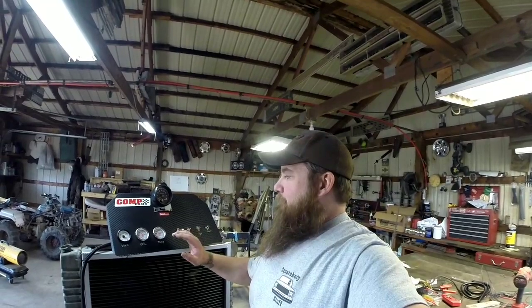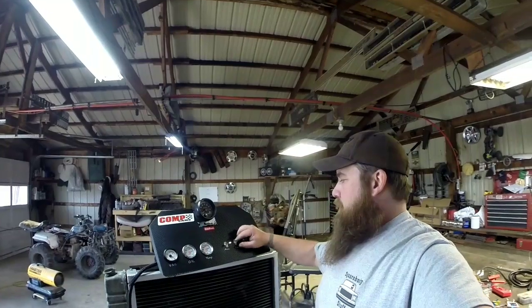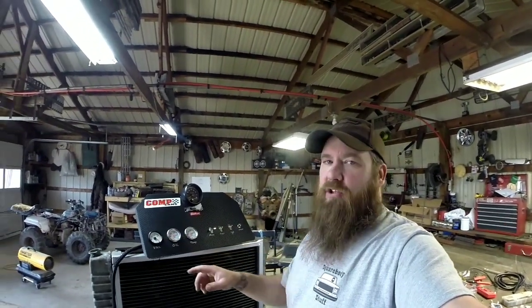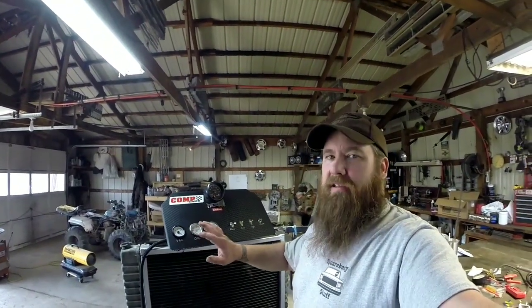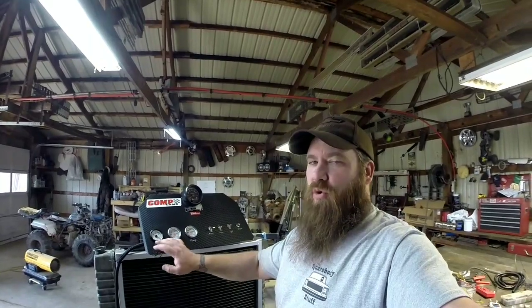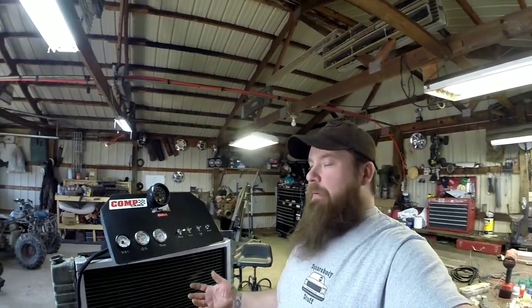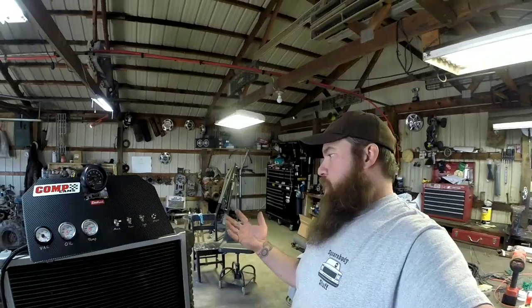But I've got vacuum gauge, oil, temperature, my main switch, fans, ignition, start, tack. It all works. I've kind of tested it. The only problem I've had is my cheap Amazon vacuum gauge. It doesn't read as accurate as I'd like. It reads lower than my other two vacuum gauges I've got. I've tested it, so I may source a better quality vacuum gauge. But anyway, it looks pretty cool, and it all is going to work.